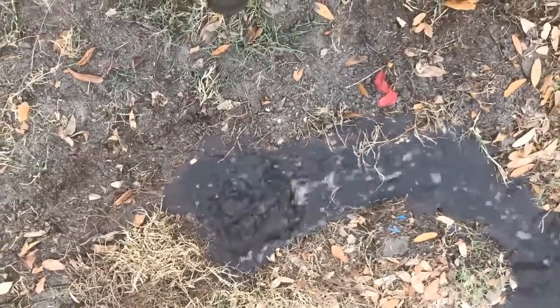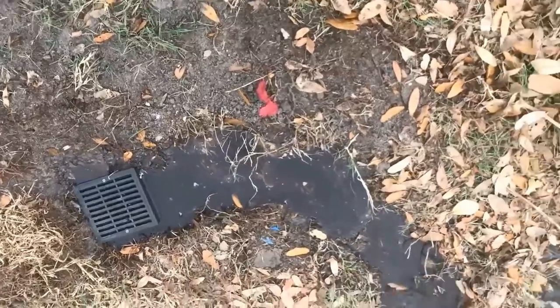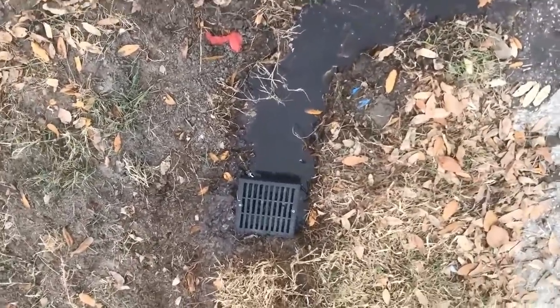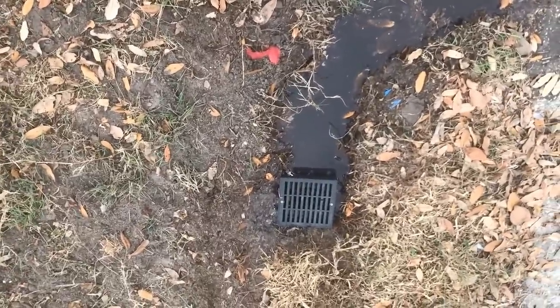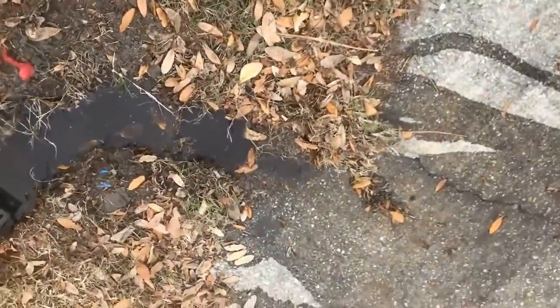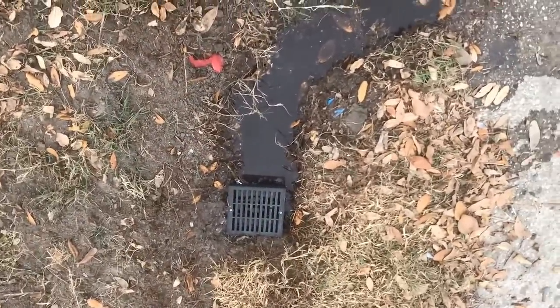You can see how we're pushing it all the way up that hill. It comes out of there quick. Half-horsepower pump, remember — we're pushing up 150 feet, 20-foot head, maybe 25-foot head. And that water easily came out here to the street. We're just using the garden hose, but during a big rain this water is gonna pour out of here.